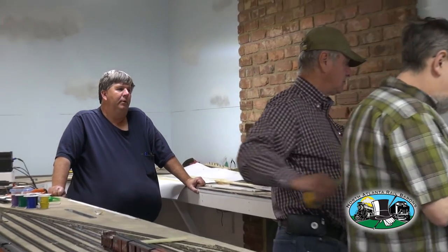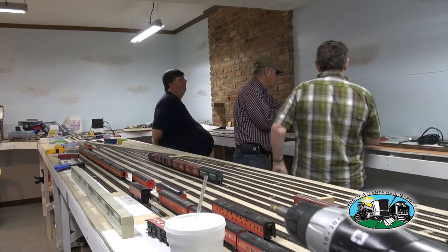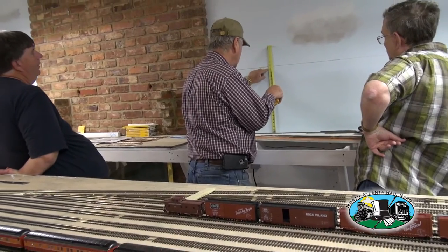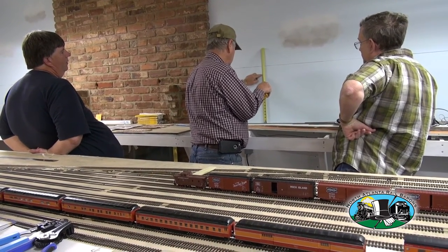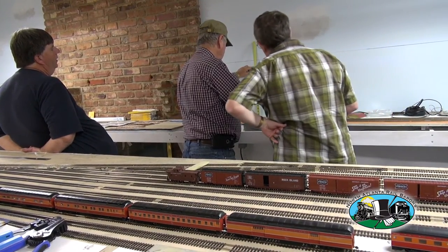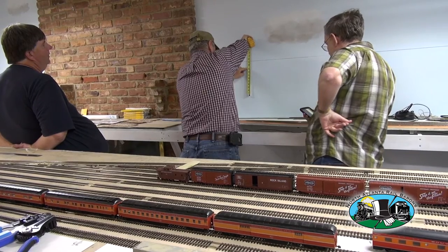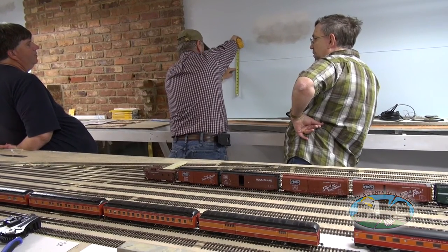You're coming out eighteen — come down nine inches. I'm thinking of eighteen: if you took half the load off at nine inches at forty-five degrees, that would be nine inches in and nine inches down. And this thing will support an incredible weight. So they don't have to come down far, but you still need something to bite into the wall. I'm thinking eight or nine inches. Nine inches will be right there. If you take half the load back at forty-five, nine and nine, you're halfway into an eighteen-inch module — that takes out half the stress load right there.